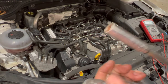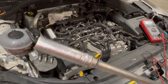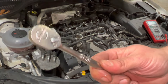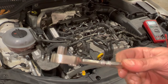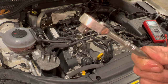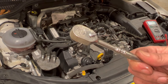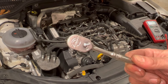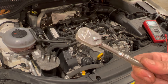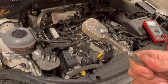All I'm going to do now is remove all the glow plugs. You need a 10mm socket for the normal ones and a 13mm socket for the cylinder sensing one. I always like to use quite a small ratchet — you've got more feel for it. Be careful with glow plugs as it's easy to snap them. If they're mega tight, give them a bit of a spray of penetrating oil. If I feel like any of them are going to snap, I'll leave them, give them a soak, and try a different day — better to take your time than risk snapping them.